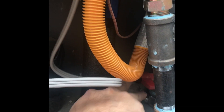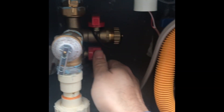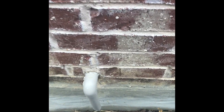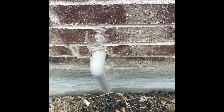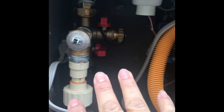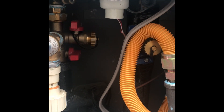The gas is now off, the inlet water is off, the outlet water is off. Open the relief valve to drain water from the water heater. Let the water drain off. I've already taken the power off and broken the circuit at the circuit board as well, just to be doubly sure there's no live current. Let it finish draining before moving to the next step.